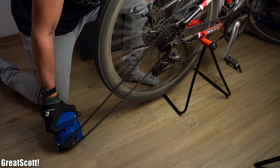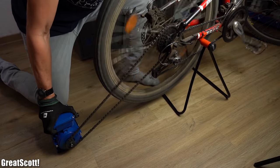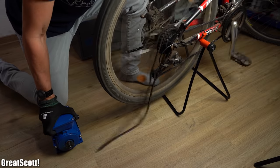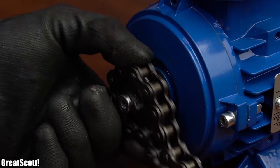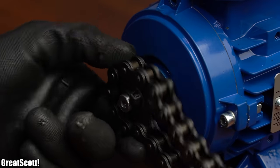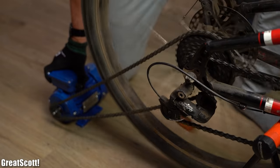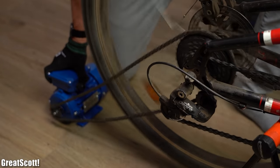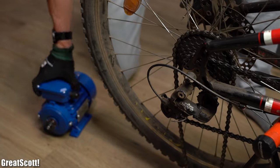The gear wheel of the motor is not fully compatible with a bike chain, which is why at higher speeds it always fell off. The gear wheel does work perfectly with a bigger motorcycle chain, but then we have the problem that the bike does not work with it. So basically, this whole bike motor idea was a mess and I decided to abort this mission.